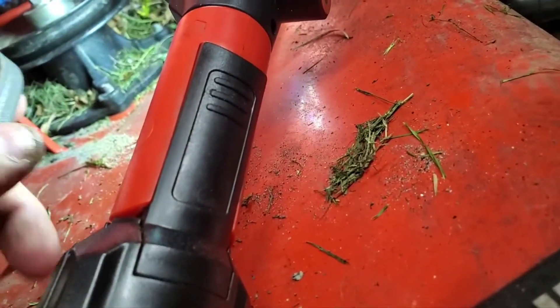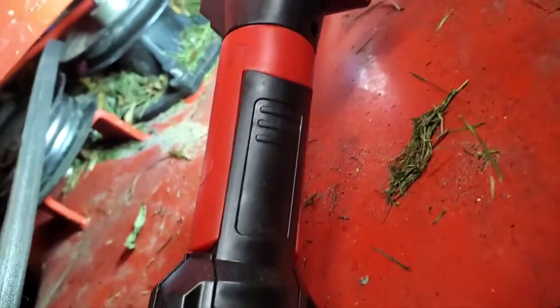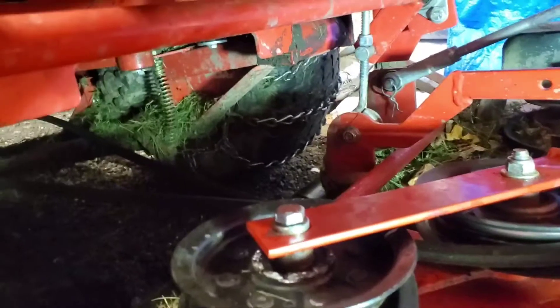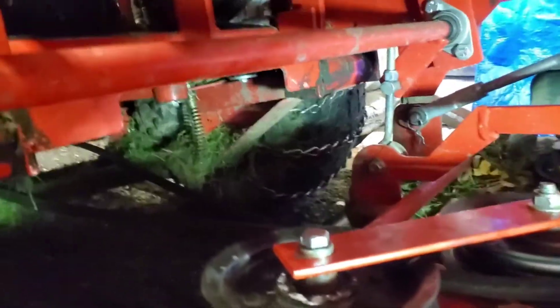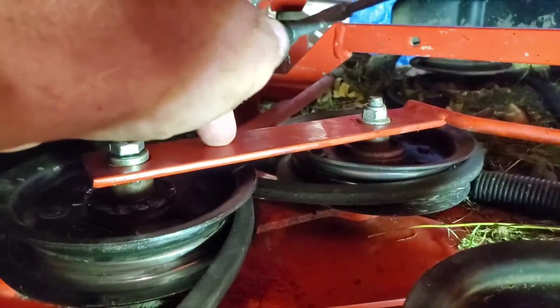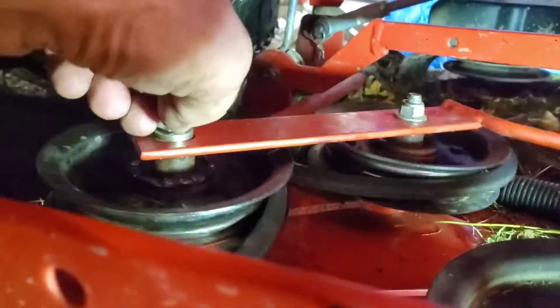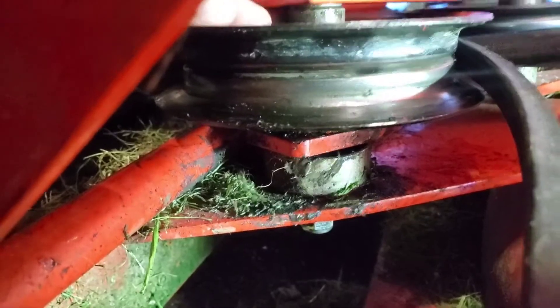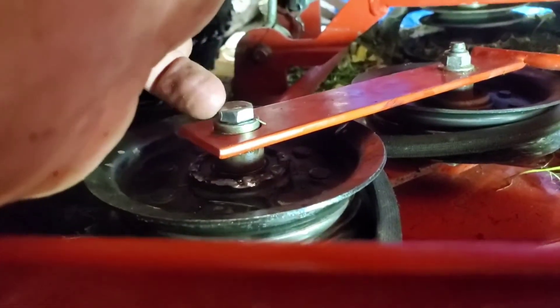This is pretty easy. When you put a belt on these, people take these pulleys off — you don't take them off. You take your belt loop and push it right between these, and then they go back around the rear pulley. I made that mistake once — I took this belt off in two seconds but couldn't get it back on. The way you start is these two adjusters right here, spring-loaded over there. That sits on a big spacer on the bottom — there's a nut that holds it, and the bottom has a raised pedestal so you don't need the spacer on the bottom. But there is a spacer that goes in the top and one that goes under this nut.